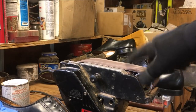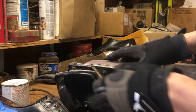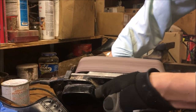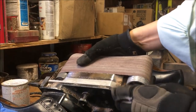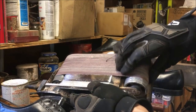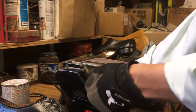By the way, the belt sander, there's this flat part here where it's got this metal plate under it. Here, let me show you. You can't really see it right now. You see the flat metal plate? So that part is really flat, okay? Let me adjust it back. And then there's this part. This span between here and the roll is flexible, and that's great for curved areas. So watch me use that area too.